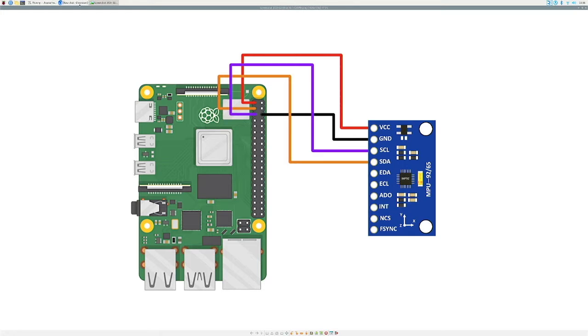Once you have your jumper wires, make sure they are fresh jumper wires because a lot of the time people can have issues with communication or the device not working, and that could be because the jumper wires are bad — that actually happened to me today. So make sure you have good jumper wires that are tight and fit nicely on the pins.